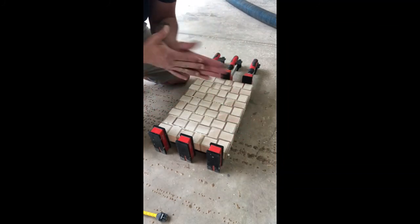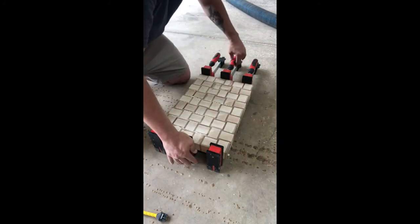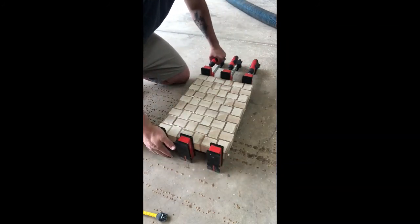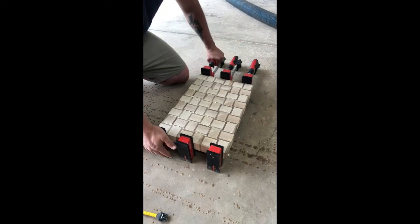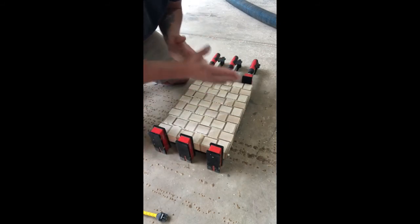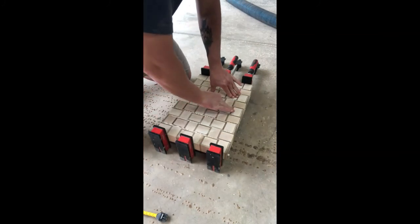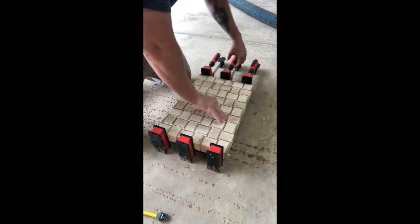Okay, and you'll just watch it. That's why you just snug it up. You know, even pressure the whole time and make sure nothing's creeping on you and everything stays lined up, and you should be good to go. Again, you could put cauls if you like them.